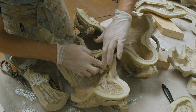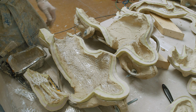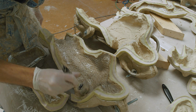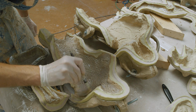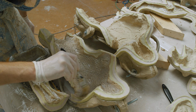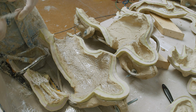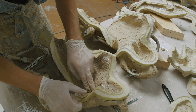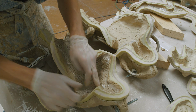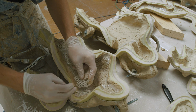Just placing the fiberglass down into the mold on top of an area with fresh resin applied is not really enough, however. We do need to do some more work to make sure the pieces of fiber are properly laid down on the inside surface of our casting. This is the very delicate and careful work of pushing on the fiberglass, using a light touch to tamp it down properly into the mold so that there are no pockets of air in between the layers.